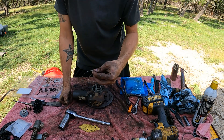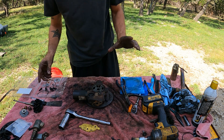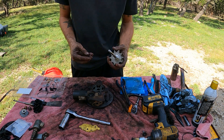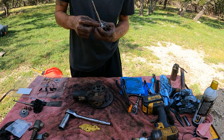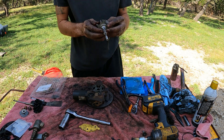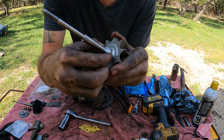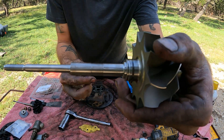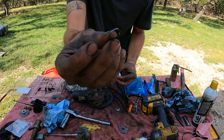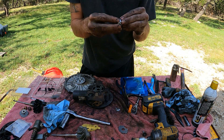We are going to get our little square o-ring placed back in the exhaust side here where the thrust bearing goes. Here is our 10-blade propeller for the exhaust side — we need to get the o-ring on it. The o-ring is the bigger of the two metal o-rings; it goes down here and we're just going to use fingers to pull it down. We're gonna slap some oil on it, then we're going to take the other metal o-ring which goes on the other end of this bearing assembly.